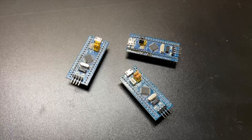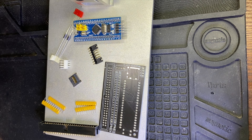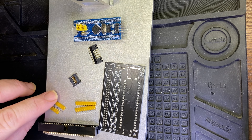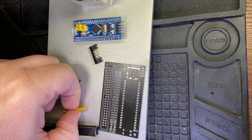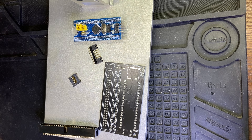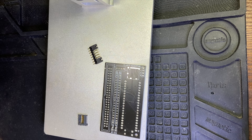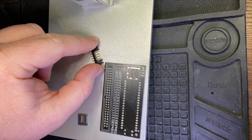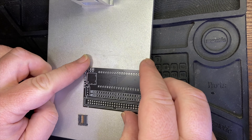As you can see, I've bought parts to build several of these for myself. Just to reiterate, these are all the parts we'll need: the diodes, the power connector, the 220 resistor packs, the 330 resistor pack, the SCSI connector, the SD card slot, the blue pill, and the jumpers and pins. We will work with the board first and that SD card slot.